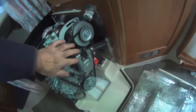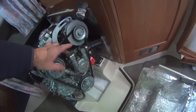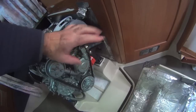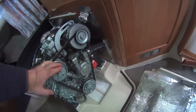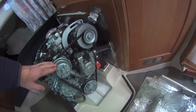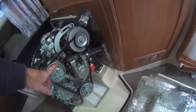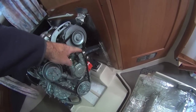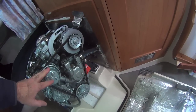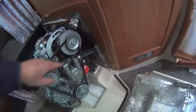There's the housing right there with a couple of inlet and outlet hoses on it. I've got to remove those, pull the pump off and pull the impeller out. One of the silly things with this Universal engine is that to change a fan belt you have to take a hose off. When I have that hose off, I'm going to put a new belt on it and leave it tucked around the side so if I blow a belt I can just quickly slip it on without undoing any hoses.